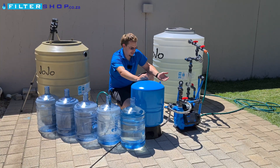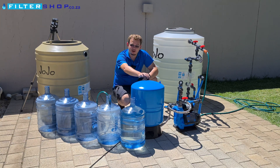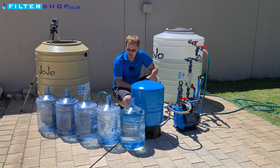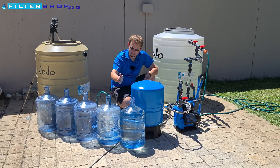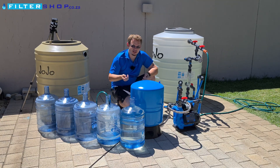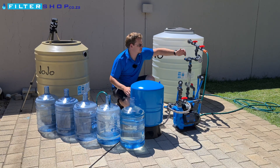The theory is that when you're running at a slow flow rate like this, the pump needs to be running constantly even though it can throttle down to provide a small flow rate. Whereas with a pressurized buffer tank, it can turn on, run at a high flow and hopefully higher efficiency, and not have to be running constantly. In effect this simulates a toilet flushing — the fill rate is slow so the pump runs constantly, but the actual amount of water is very insignificant. We'll do a few of these to gauge a typical real-world situation.